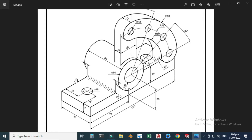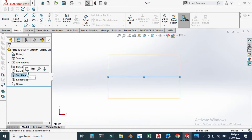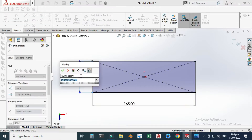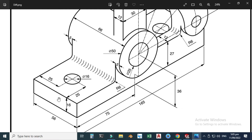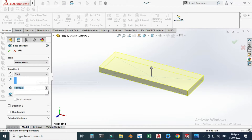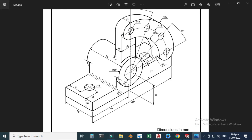Let's go to the drawing. First, I will create this base part — you can see these dimensions. I will create a rectangle using the top plane. Now you can see that we have an extrusion of 16mm. Let's go to SOLIDWORKS again and exit. I will go to Features, Extrude, and I will extrude it up to 16mm and select OK. So this base is done.